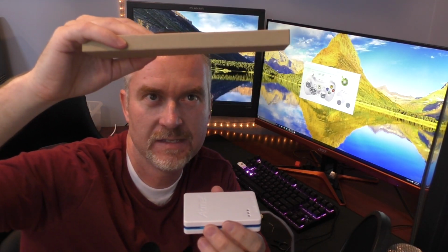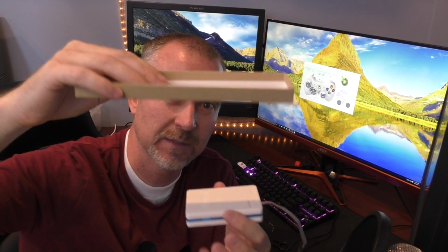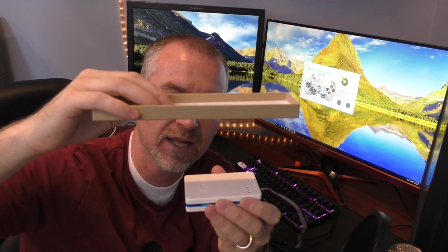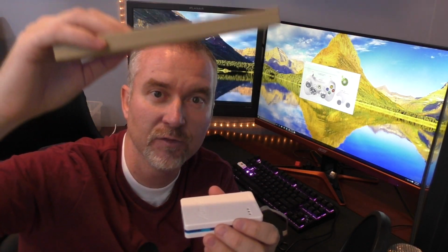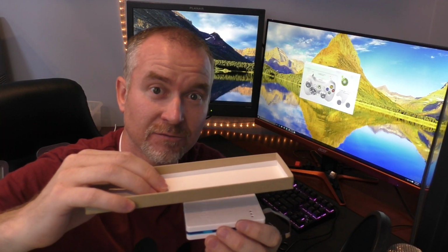When the switch is up at the top, there's a low amount of light getting reflected back because some of it's scattering off in different directions. But as you push it down, more and more light gets reflected back onto that second part of the sensor, and that gives you the variability of the switch as you're pushing it down. It knows that when it's this close, there's a ton of light getting reflected, and that alters the amount of voltage being monitored. So we have a big swing of values and translate that into some type of meaningful use for games or mouse control or things like that I previously demonstrated.